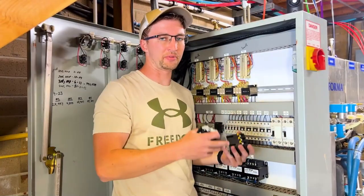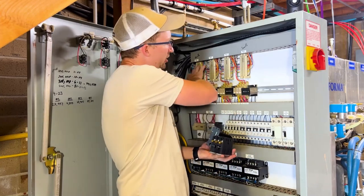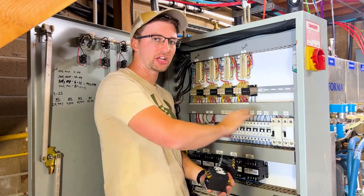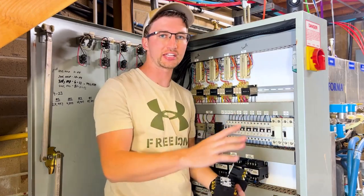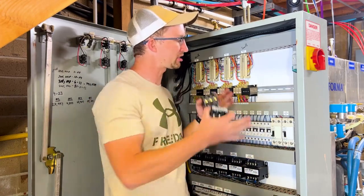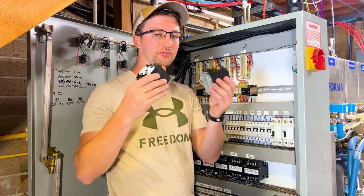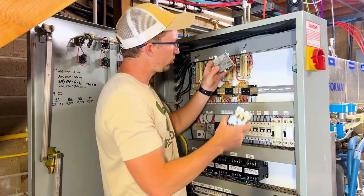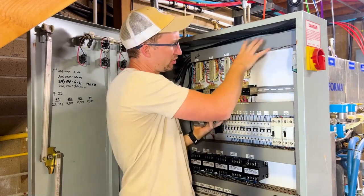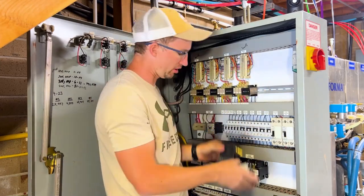Inside the electrical cabinet on my pump stand, I've got a lot going on. You have all of your different functions from your meter boxes out in the bays coming in, then you have transformers, disconnects, contactors for your high pressure pumps. I wanted to keep everything isolated inside of this electrical cabinet, so I was planning on stacking the contactors for the air chamois in here somehow, but as you can see it's a really tight space.